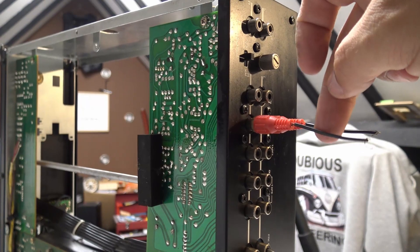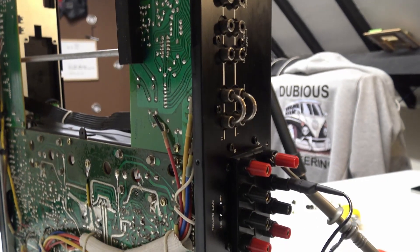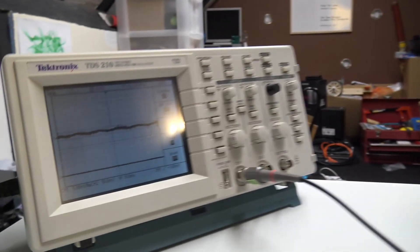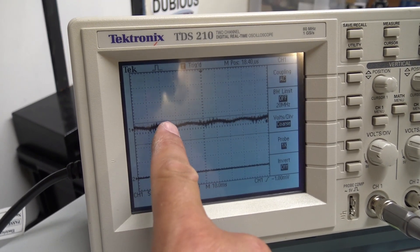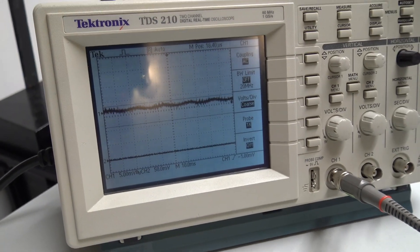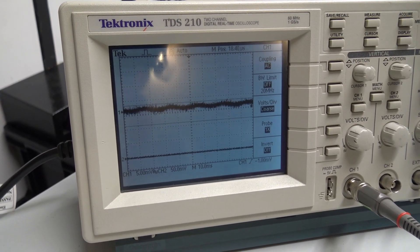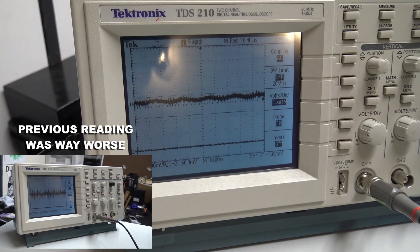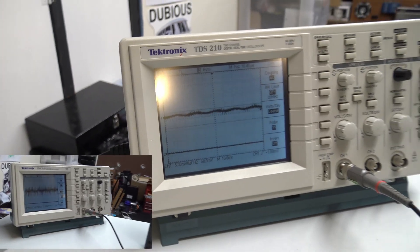This is quite impressive. I've put blanking plugs into the CD input, set everything on CD input, and I'm looking at the output of speaker A on the scope — this is on 5 millivolts per division, a really very small amount of noise; you'd never hear that on a speaker. Turning the volume up to maximum, hardly any change. There was a little bit of crackle and pop earlier but that seems to have gone away. I'm pretty pleased — that really helped.